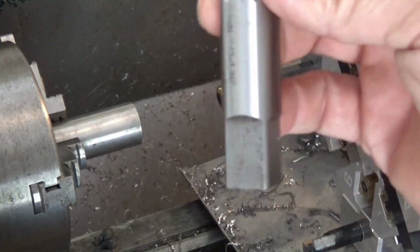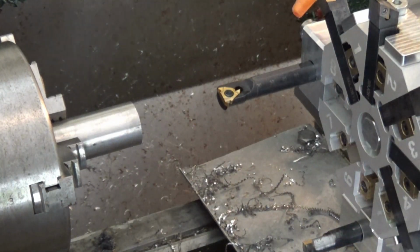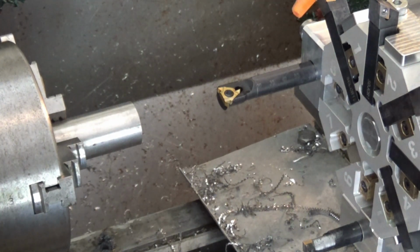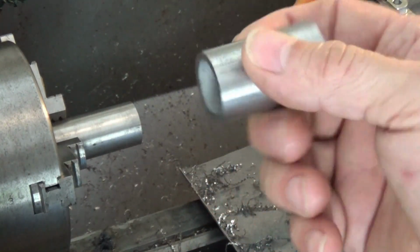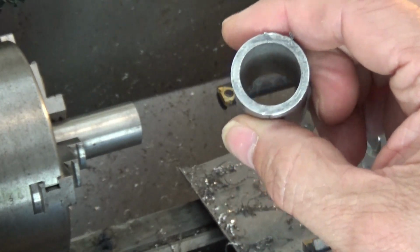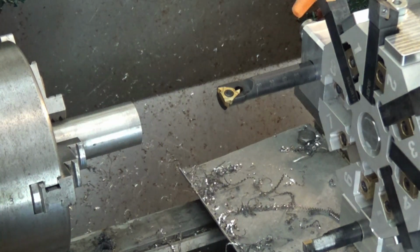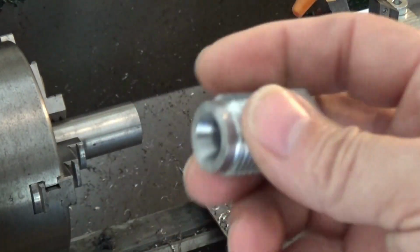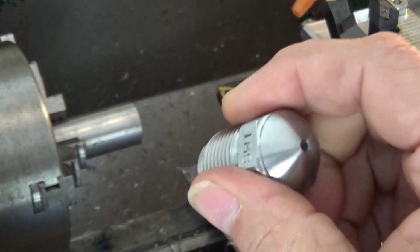I can use a tap, but as you guys know, tapping a hole like this, especially in some tube, can be a pain in the butt. So we're going to give it a shot on the G0602. Now this is some 1-inch seamless stainless steel tubing. It's a 0.120 thickness on the wall. And this is for our nozzle. So our nozzle is 7/8-14 thread.